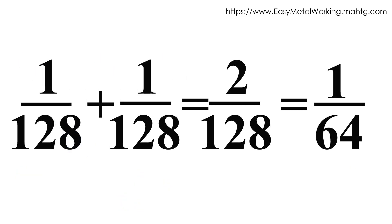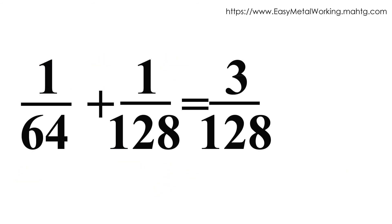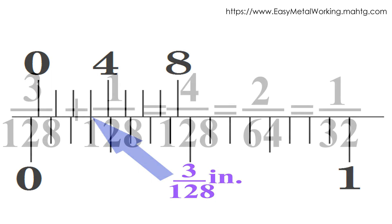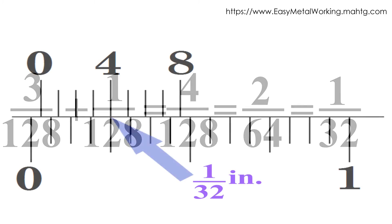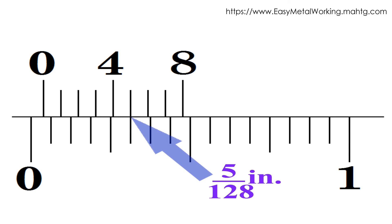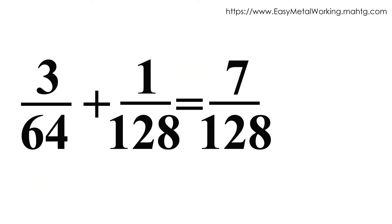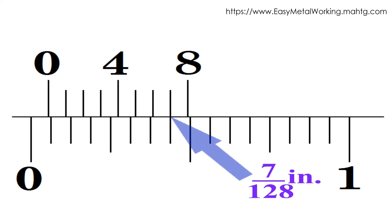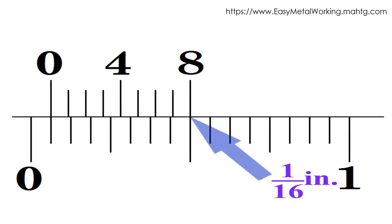Building the Vernier subdivisions: 1/128 equals 1/128; 2/128 equals 1/64; 3/128; 4/128 equals 2/64, and simplifying gives 1/32; 5/128; 6/128 equals 3/64; 7/128; 8/128 equals 4/64 equals 2/32 equals 1/16. Conclusion: eight over 128ths is equivalent to one sixteenth of an inch.